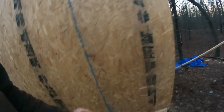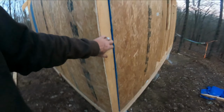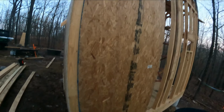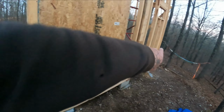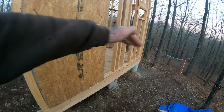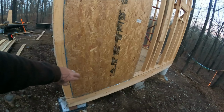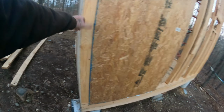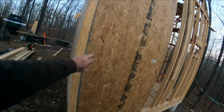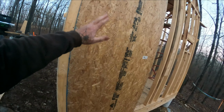Another thing is, when you've got a California corner like this, and you start a piece like this, start from the spot over there where you got that exterior stud, come this way, this is 12 foot, and then I should cover over here with a piece, not have to have a little piece. That's another one, and I'm probably going to redo this, which is no big deal.